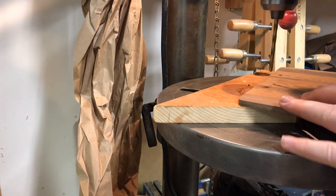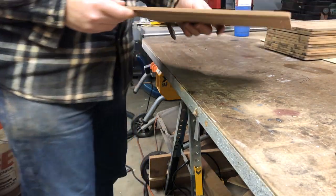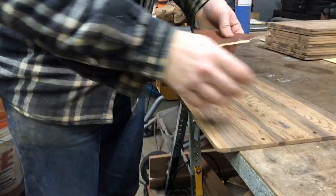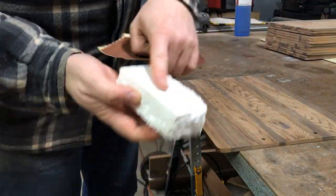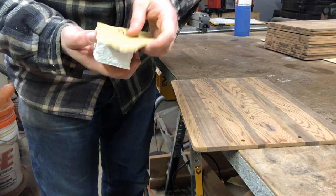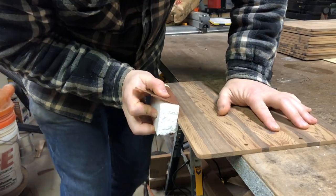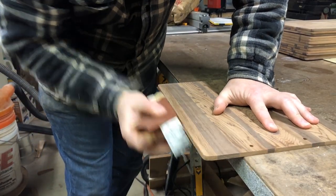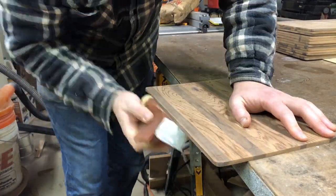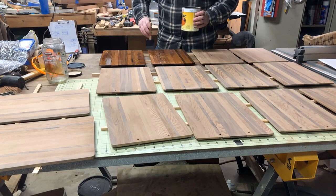I'm only drilling part of the way through and then flipping it over and drilling the back to avoid blowout — and then you get a very nice edge. What I found works really well is to take some styrofoam, make an indent that roughly fits the shape, throw some 220 on there, and then push into the side as you sand. This kind of rounds the corners over, but not so much that it's obvious. It's a really soft round over and it feels really good in the hand.